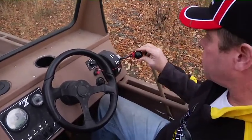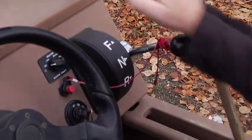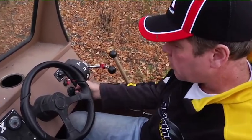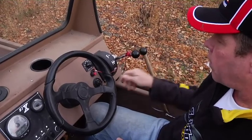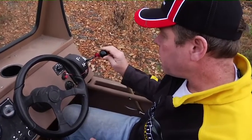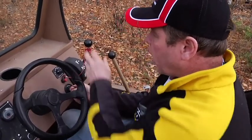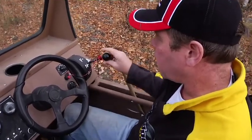The remote control is a single lever remote control with neutral, forward, and reverse. We prefer this over the dual lever because it's so much easier to make an emergency maneuver. The boat will not start unless it's in neutral — if it's out just a little bit, the horn comes on but nothing happens. You have to be in the little detent area and then the boat will start. If you're floating down a river and need to start quickly, you can hold the key all the way over and move the control down until you hear it start.